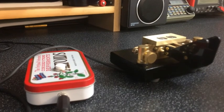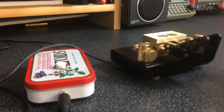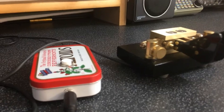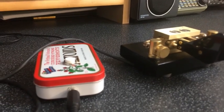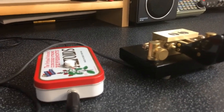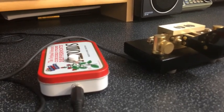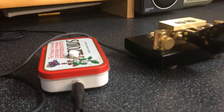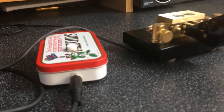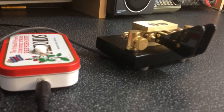There are four memories. E gives us memory one, I memory two, T is memory three, and M is memory four. It's easy to set — you press the button and send the number one, two, three, or four. It'll reply with the letter R to say it's ready, then you just send the message you want to record in that memory slot. Once you've finished, just leave it — after five seconds of not sending, it'll store that into non-volatile memory and it'll be there for the next time.